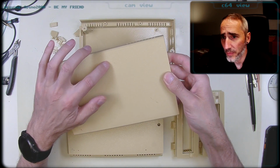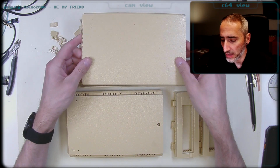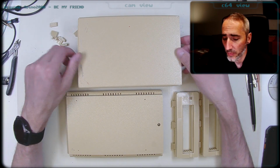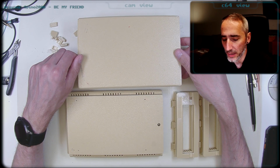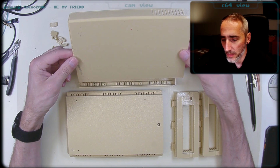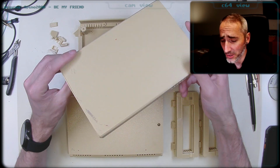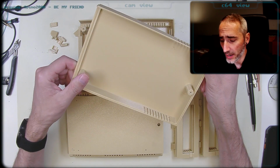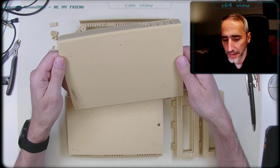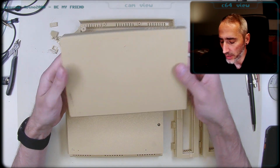And these reddish parts came from the nozzle. It wasn't completely clean. Not the nozzle itself, but the surrounding of the nozzle. So I had printed reddish material, and there was some remaining material on the nozzle. When it became hot, it melted into the normal filament stream and contaminated this lid. Since this is the top side, it is somewhat disastrous, but fortunately the guy I'm printing this for is able to do some rework on these cases, and he's probably just going to paint this in some way, so it's not a waste of material, and it's still a nice looking case.